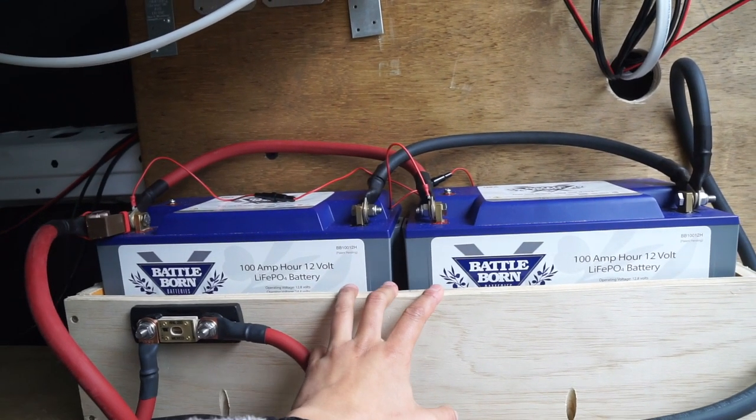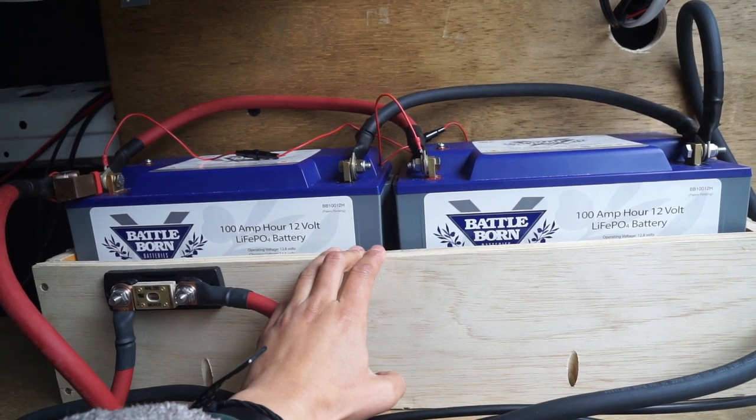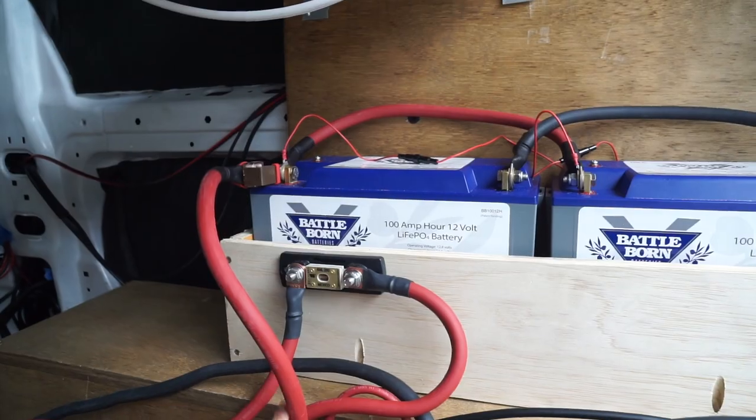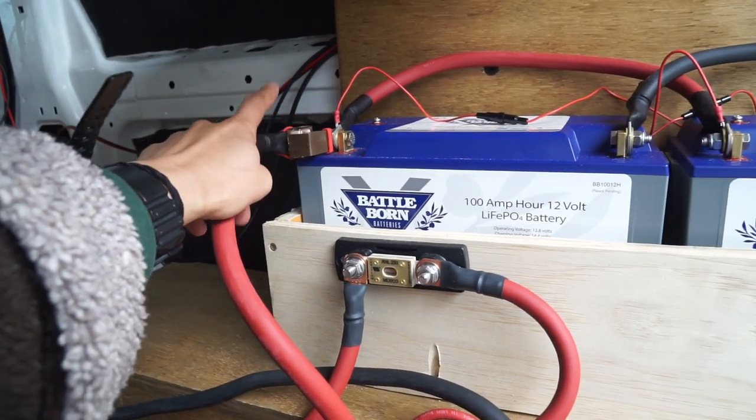Now that I've got all my wire connections set up, we're going to go over everything. I'm going to explain all of the connections coming back to the bus bars — this may not necessarily explain the way the current is flowing, but I'm hoping I'll explain that at some point. I have two 100 amp hour batteries in parallel, making the system 200 amp hours on a 12 volt system. When you connect in parallel, it changes the amperage, not the voltage. Our positive comes out one end to the bus bar and our negative comes out the other end to the bus bar. On the positive end, we have a 250 amp terminal fuse that connects directly to the bus bar. At some point I'm going to want to put an on/off switch on that wire, but the on/off switches were on a five-week back order, so I just used the terminal fuse directly to the bus bar for now.